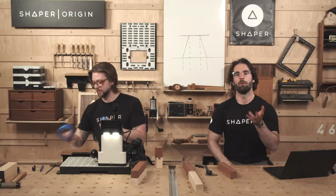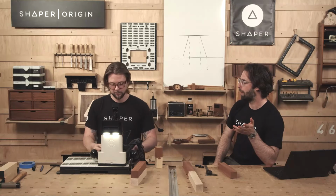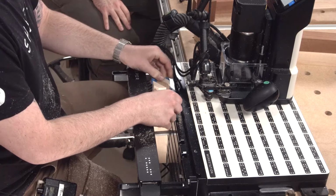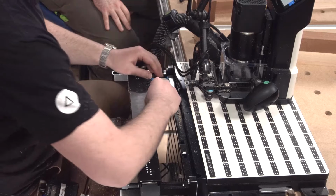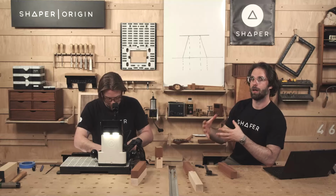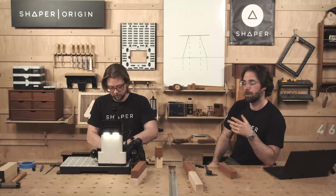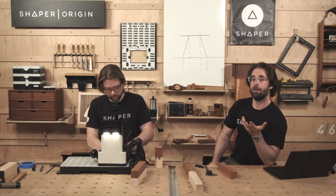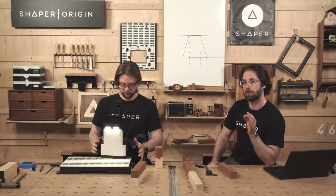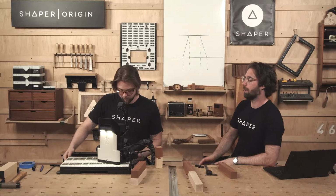Okay, the blue tape. So we're going to do this dovetail cut in 2 steps just to make it a little bit lighter on the bit. You said we're going to negative 0.05-inch offset for the first cut, and then a minus 0.144-inch offset on the second cut. And the reason for that, again, is because for this second half of the cut, we already did the first cut. Over here for the second cut, we're going beyond the line to make sure that the 2 angles of that dovetail overlap each other. And we're doing this in 2 steps to make it easier on the bit. A negative offset is always going to remove more material, so we're going to go to a minus 0.05-inch to start to remove just a little bit extra material, and then a minus 0.144 to take it all the way up to the edge to where we want to be.